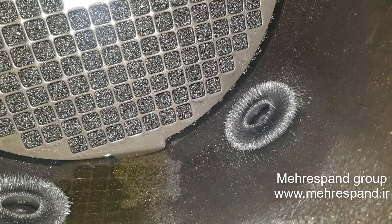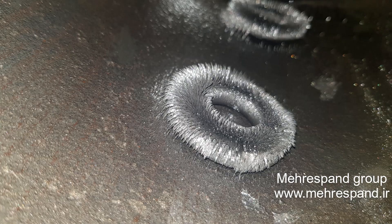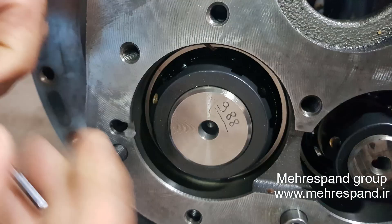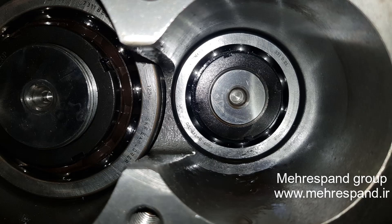The magnets in the oil sump had caught a high amount of iron filings, created by abrasion of mechanical parts. We then removed the cover, piston, and discharge bearings. The slider parts have good condition, so we removed them and proceeded to check the bearings.